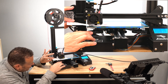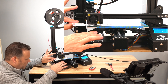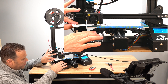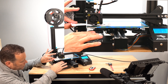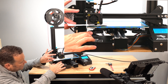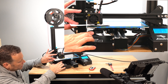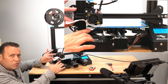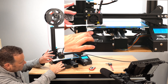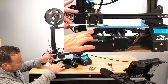Keeping the paper moving, slowly turn the dial. Right there — I can feel that little bit of vibration, just a couple degrees and I feel that tension. You can see the paper is moving but reacting. If I go just a little further, the paper binds up — that would be too tight, meaning the gap is too small. Back it off. The paper's moving freely again. Slowly tighten up the gap once more — and there, I feel that tension. That's the sweet spot. Any more and it starts binding; any less and it's moving too freely. That's a perfect level right there.